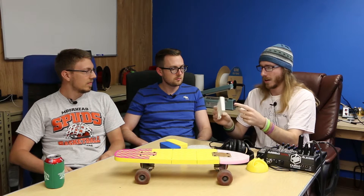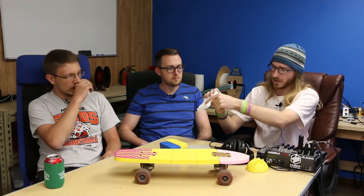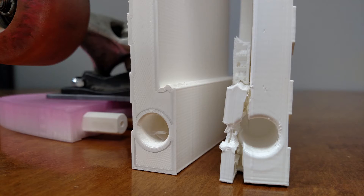These were printing horizontally before, and I realized that the way this part interacts, you get a lot of delamination and it just ended up cracking. So I put the channel in and I also printed it vertically now — I did five shells, a lot of shells. You get that strength all the way around and then it'll hold the part in the bottom better so it won't fall apart or crack when I step on it. But whenever you step on it you hear a lot of creaking, which is really unsettling.